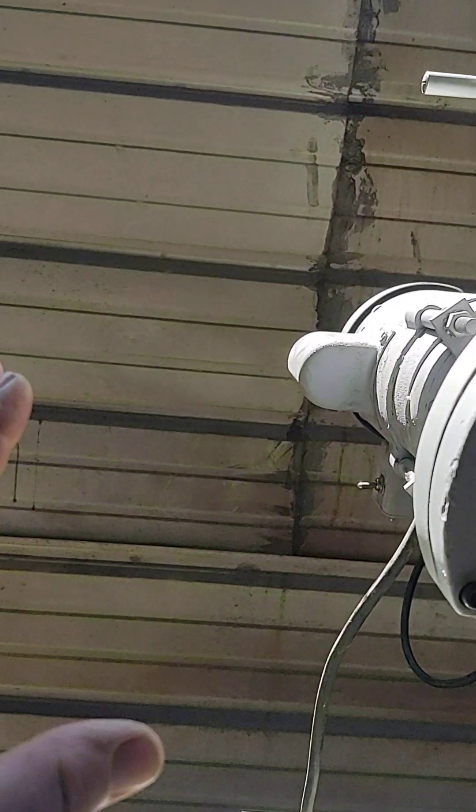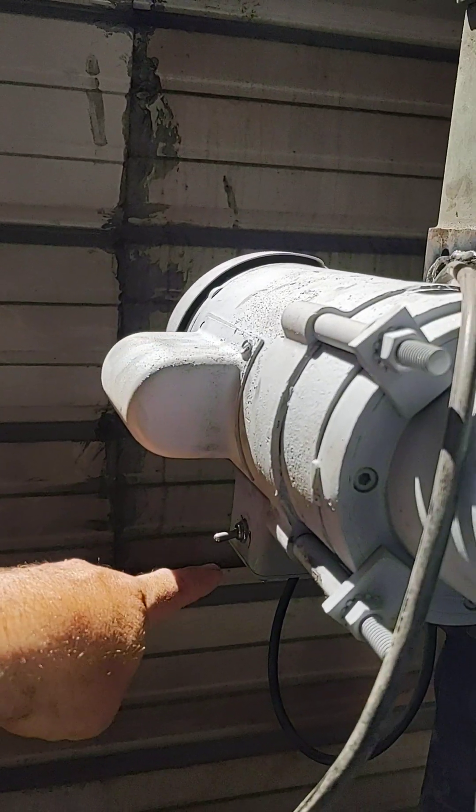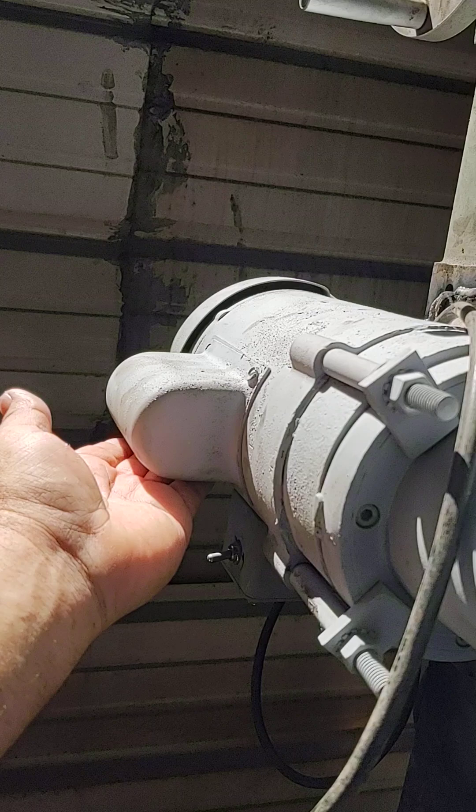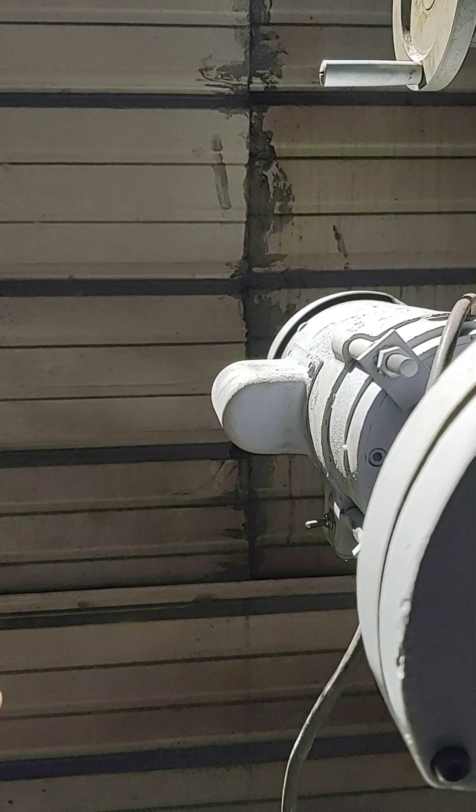With my electrical background, I recognized this is a capacitor motor, which means there's a capacitor on it. I just took the junction box apart - there's a sticker on it to tell you that if you want to reverse it, just switch two leads. You can do that on a lot of single-phase motors that have a capacitor start. Regular single-phase without a capacitor, you can't reverse rotation; with a capacitor, you can.